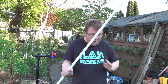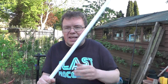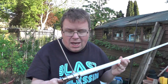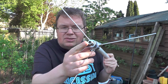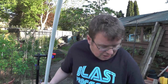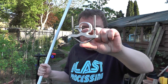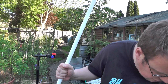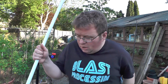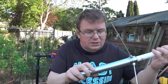In the box you get everything you need for the antenna: a little mounting pole, the antenna itself, three radials that just screw in, and on the bottom of the antenna there is an N-type connection — you'll need to convert that to PL-259 like I've done. You also get two mounting brackets so you can mount it onto a bigger pole, and two screws to hold the two poles together.